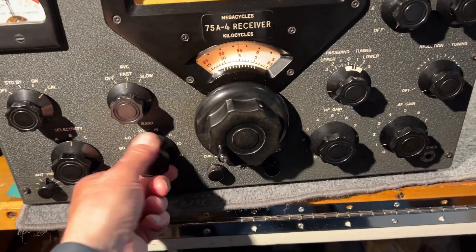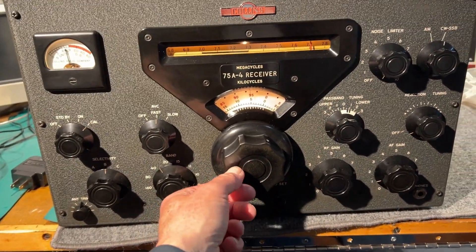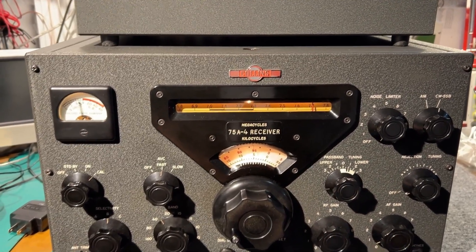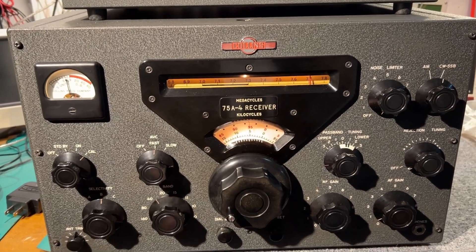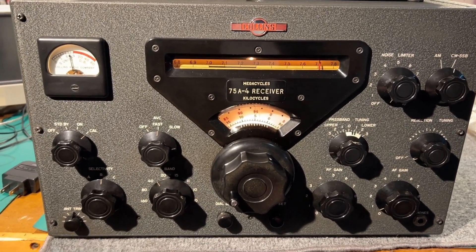So it's pretty accurate on the calibration. It's been on about 15 minutes so it's not really enough time for it to warm up fully. It takes about 45 minutes to an hour to warm fully and stabilize. I found it actually stabilizes about 100 hertz higher than the switch-on frequency at room temperature.